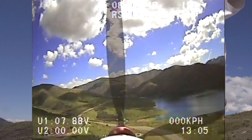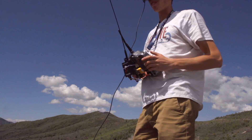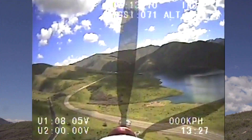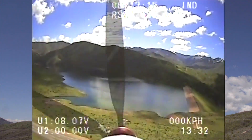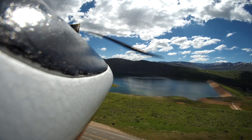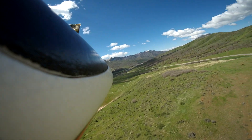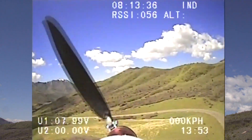It has 2.4 GHz video and Dragon Link for control. I've got 16 SunPower Maxeon solar cells. It's definitely not enough cells to be able to power it entirely, but it should definitely help a little bit with extending the flight time. The cells are tied directly into the battery. It's a really simple circuit — there's no charge controller or anything like that.